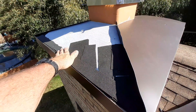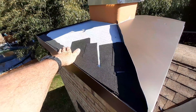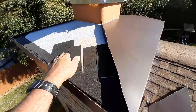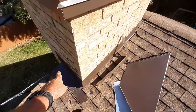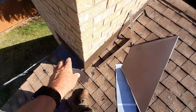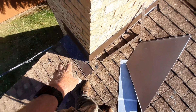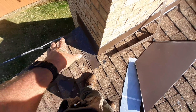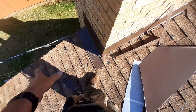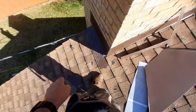The wash — I don't know — it's loose, and water was leaking, capillating back inside, and that's why we had to redo all of this down here. We had sheathing and a bad rafter in here. There were still some parts in here that were wet, but they were good enough to leave, so I left them — now they'll dry.